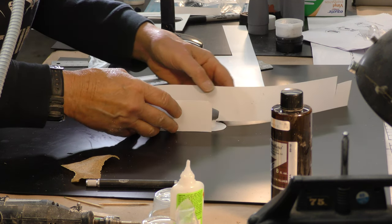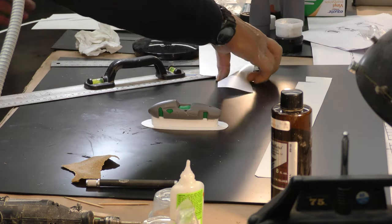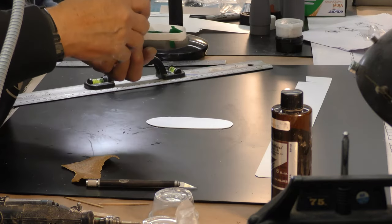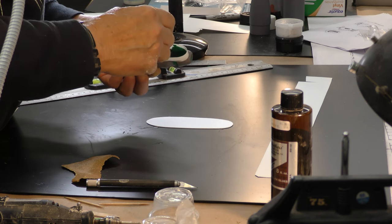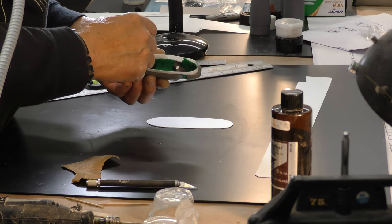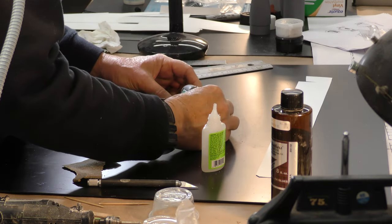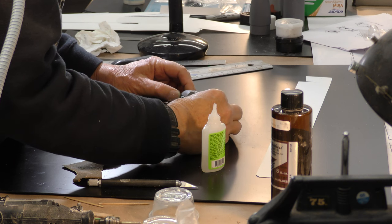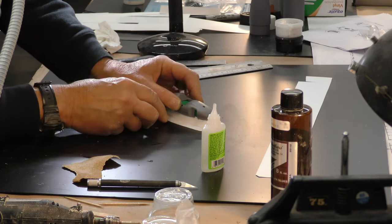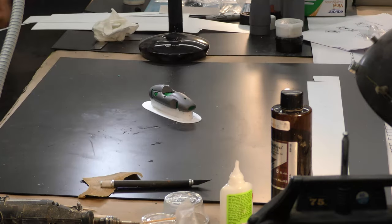I'm going to CA it all the way around like so, and then I can fill this with silicone when the time comes. But right now what I need to do is glue this to this, so I'm just going to put a little CA on the bottom here. We don't care about getting this master back again — it will remain a master for the rest of its life in case I ever need to make a new mold, which you always do, depending on how many you sell. That'll sit there like that and it glued down pretty quickly. Now to make some keys.